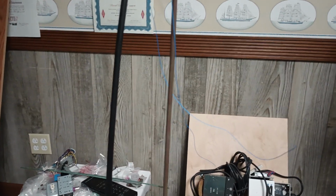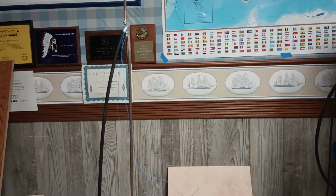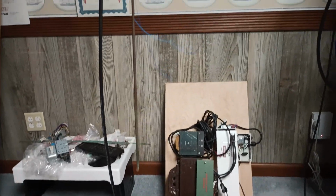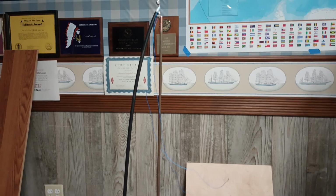And the skinny mini blue wires went to the high dollar capacitance meter. And 4 foot of cheap RG58 coax. Coax cable tends to have about 30 picofarad per foot. So about 120 puff worth of capacitance there.